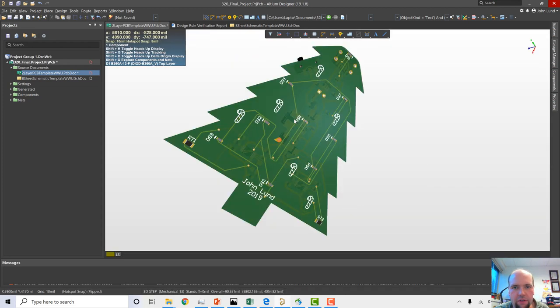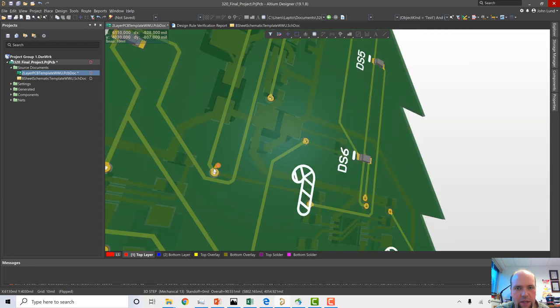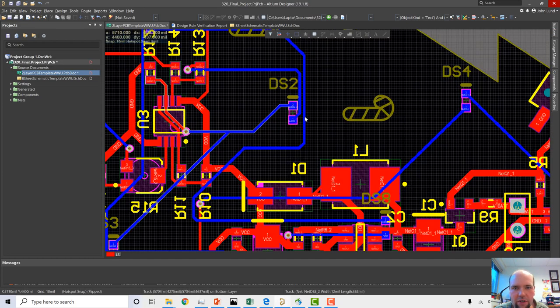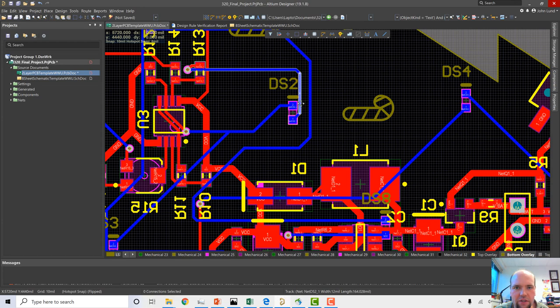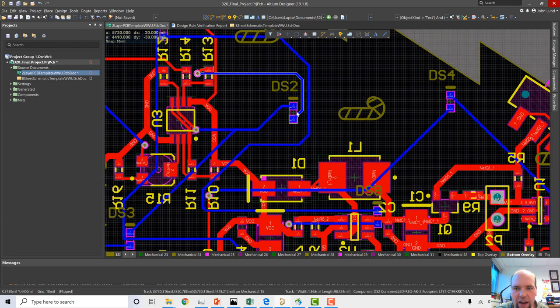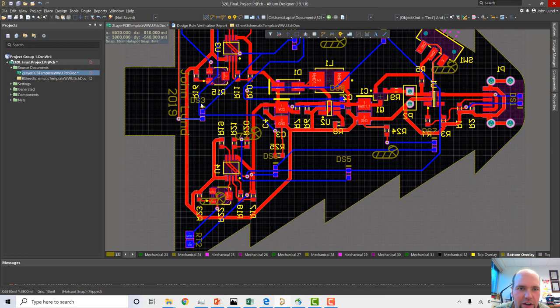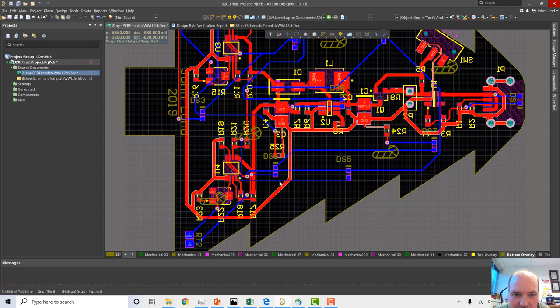One thing I might do, if you look, anywhere where they had these connections, these vias, they're exposed. So you're going to see exposed metal. So a lot of times I like to tent these. So tenting them is pretty easy. If you want to tent, actually I'm also going to move some of this around, just the auto route cut it a little close. There's no reason for that. If the fab's a little sloppy, you're going to have exposed metal there and you're going to run a risk of accidentally hitting that.